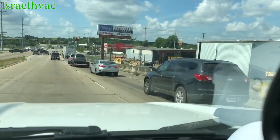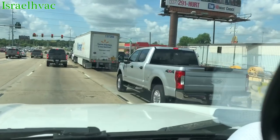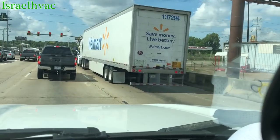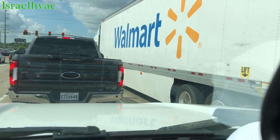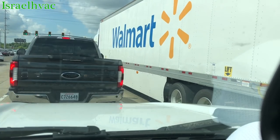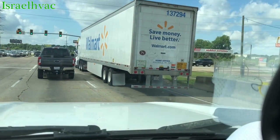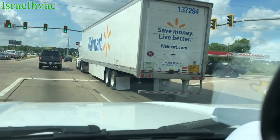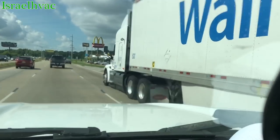Most of you are cool about it — I tell you it's the camera and you say okay. But I've had some comments that said, 'Hey dumbass, you better go back over there, your fan motor's spinning backwards.' If you want to go over to Anti-DIY HVAC's channel, he did a video on this where he took a dollar bill and put it up against the condenser coil and you could see it being sucked in. Then he put a dollar bill on top of the condenser and you could see the fan motor blowing the dollar bill up, not sucking it down.